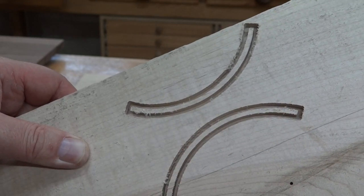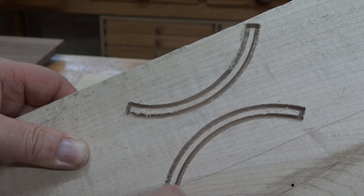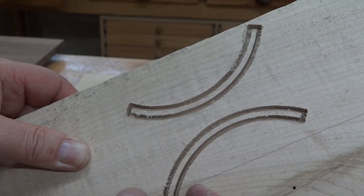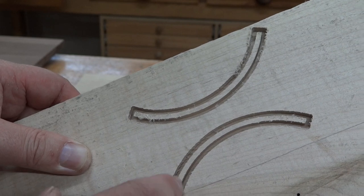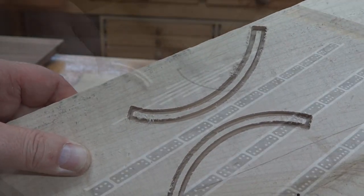That allowed it to turn into an eighth inch actual shaped space, and then I made an outside cut, and I put a 5/1000th tolerance, so it'll be 5/1000th on either side, smaller than the 1/8 inch hole that was cut for it. Now I'm gonna go slice these off at the bandsaw, and we'll see how we did.